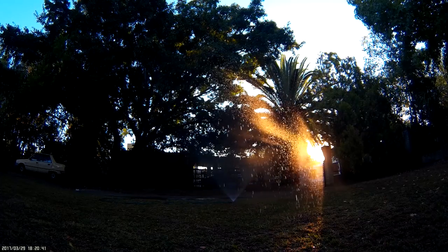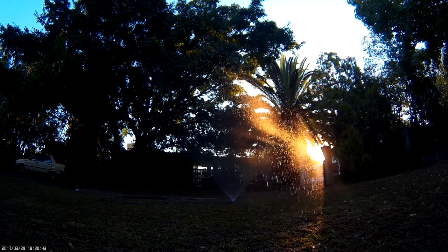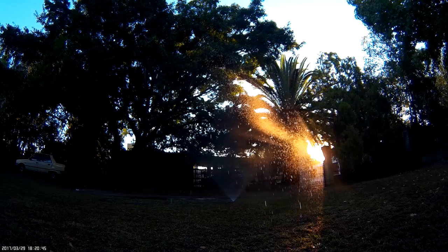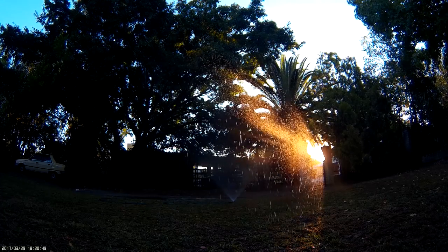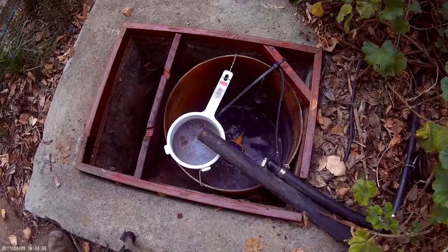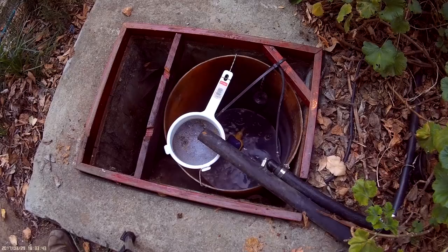It's quite efficient. The sprinkler itself is just this very simple sprinkler that cannot really block up, and therefore is quite efficient. So the level switch has got a fair amount of hysteresis, and as you can see, it's going to stop any minute now, and it gets to the bottom before exposing the foot valve. There we go.